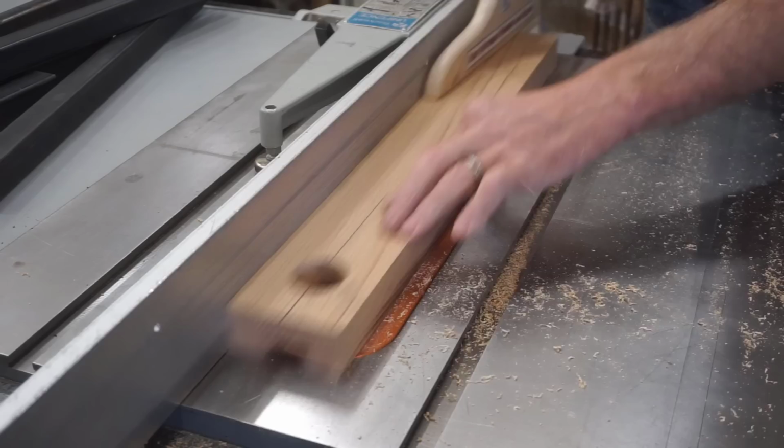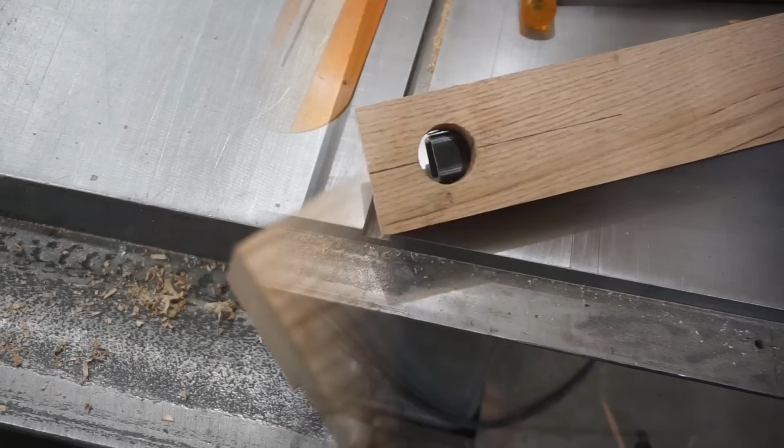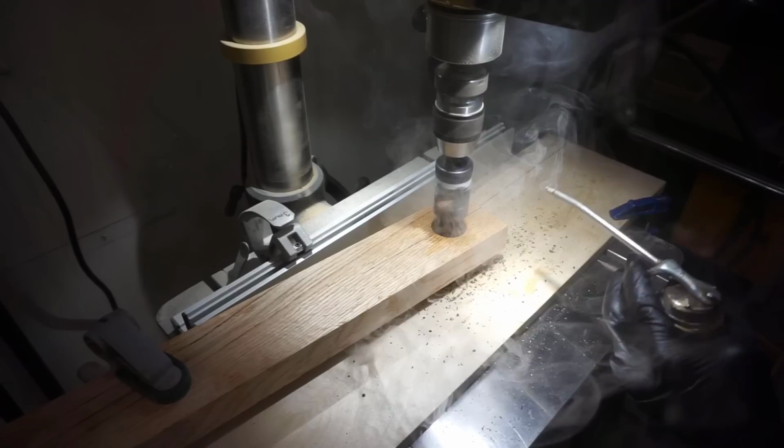Once the drilling guide block is made, using it is merely a matter of dropping it onto one of the leg tubes, aligning the hole in the guide block with the layout mark for the round notch, and clamping it into place. With this block as a guide, I can use the hole saw running at low RPM without its pilot bit to cut the round notch exactly where it needs to be. Even though it's messy, I use a generous stream of cutting oil while drilling this round notch to make the notching process quicker and extend the life of this hole saw.